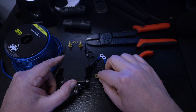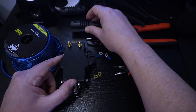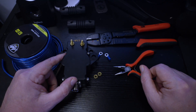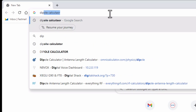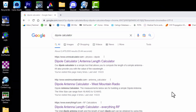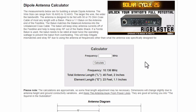We've got a couple of nuts that go on top, some ring terminals, a crimper, and we're going to need a couple of these dog bone insulators outside. First thing I want to do is open up a web browser and search for a dipole calculator. I've looked at a few before — the West Mountain Radio one is pretty straightforward. The frequency I want is for 30 meter FT8, which is 10.136 megahertz. I'll go ahead and hit calculate — and there are our measurements.